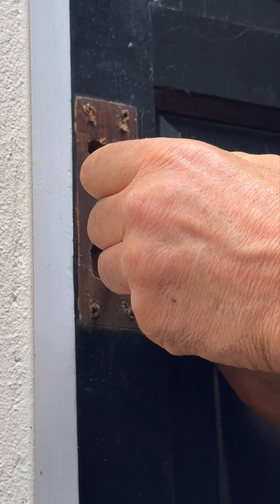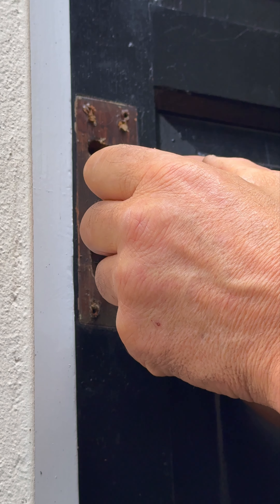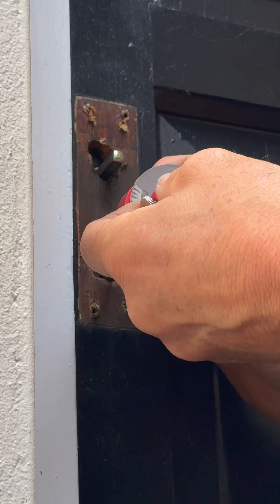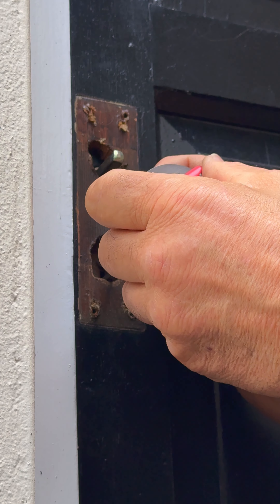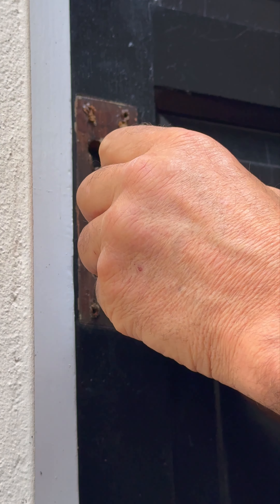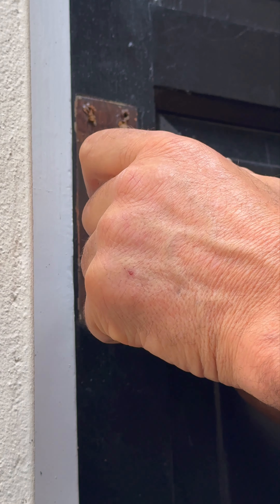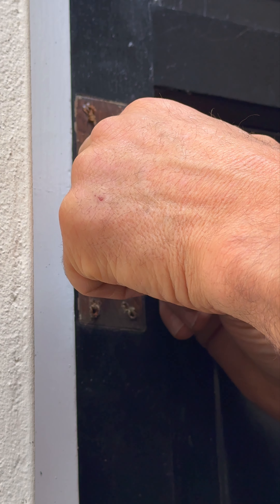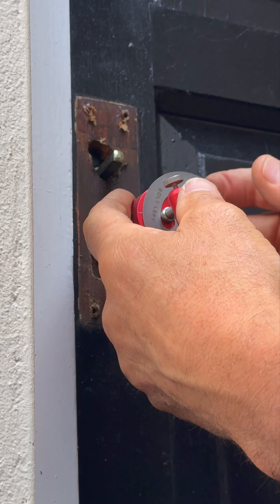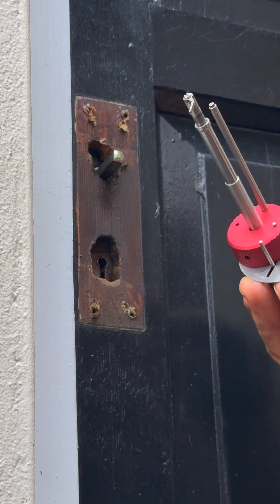Going one more click — okay, that's allowed it to go around quite some way; in fact that's gone all the way round to just beyond an H, which is a one. Let's push it all the way to the back — reading the same. So levers three and five are the same because of the ABA pattern. Pulling it out one — that's moved back one gradation, which is going to be a two. So there's a one, two, one at the back there, and a seven at the front. So we've got either a seven-five or seven-four, one-two-one in there. I'm going to build a makeup key and then we'll see whether I've actually decoded that correctly.